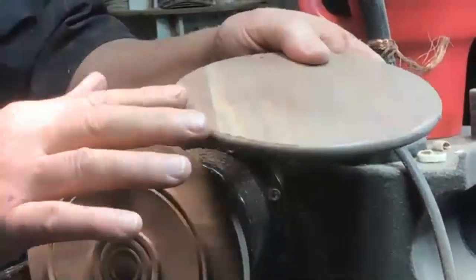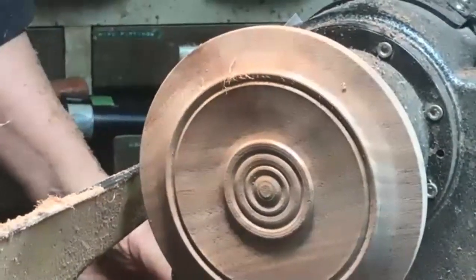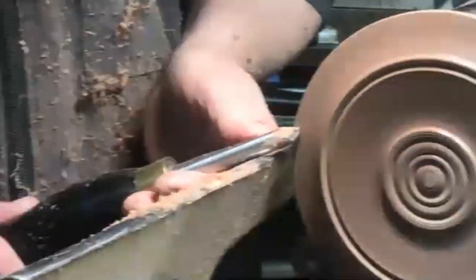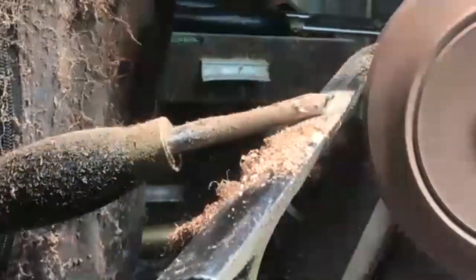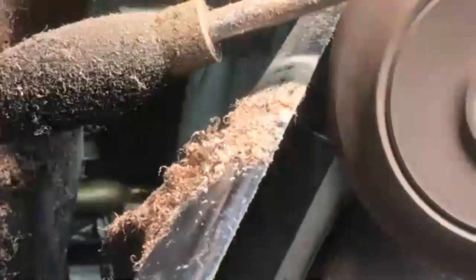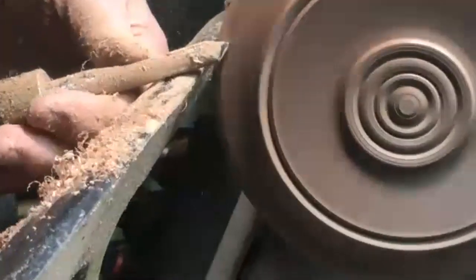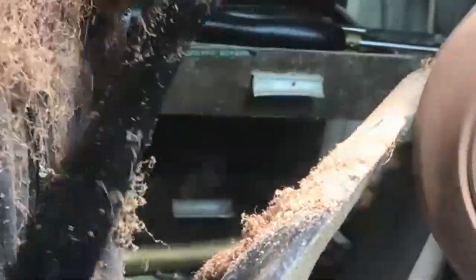All I have to do is sand a little bit off that bridge right here in a few places to match it up. I want to match this one pretty much to the other one. Starting with the handle down low - a lot of shear cutting on this project - and just disappear off the edge. I'm moving from here up toward the tip but never getting the tip into the wood. The handle's going down even lower. I can flip it over and do the same thing from the other side.